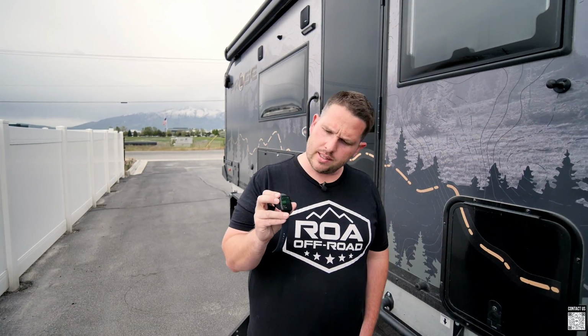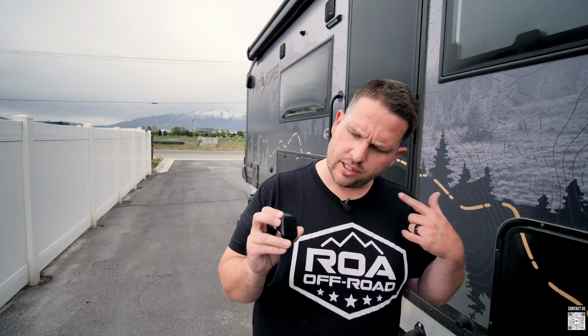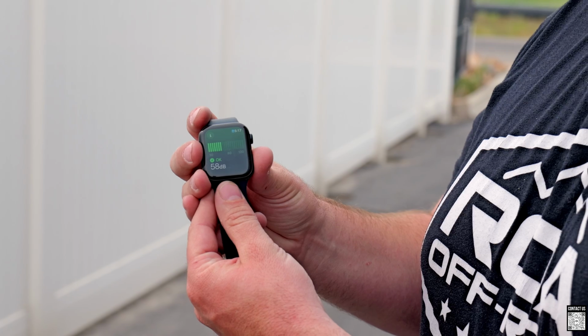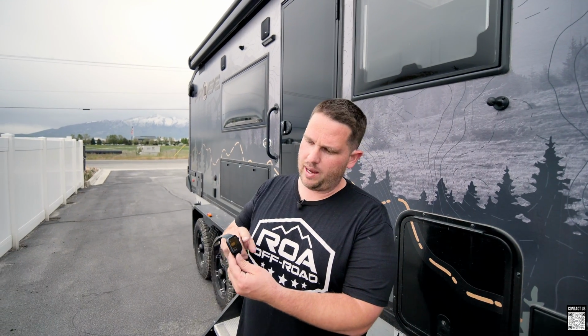Yeah, so as you can see, I'm talking, I'm gonna go silent for a second. Well, a car just drove by, that's why I went from 60. But just sitting right here, right next to the outside kitchen, we're talking 58 to 65. With the road, every time a car drives by, it actually gets loud. When the cars are not driving by, it drops to 57. Like, that's pretty good. And so if you're out cooking right here, you're talking 55 to 60 decibels, which is quieter than me talking. So it is a very quiet generator.